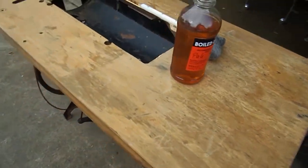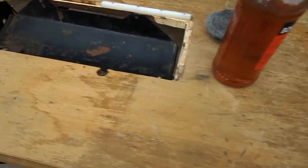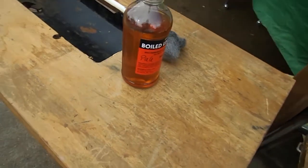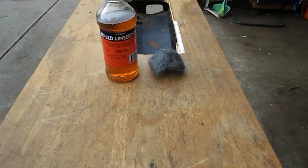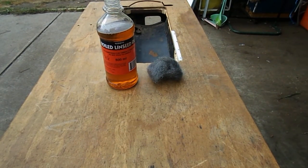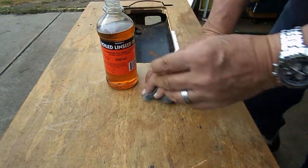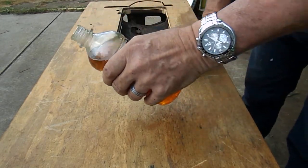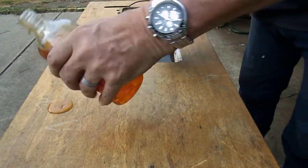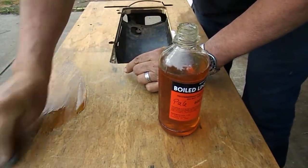What we've got here is this is a base that I've just pulled out of the shed. You can see the condition on it is pretty solid and strong looking, but the actual coating is pretty deteriorated. So what I'm going to do is just use double-O steel wool — where we normally use triple-O — just to show you how it comes up with an initial once-over. You can see marks like this just come out with the steel wool.